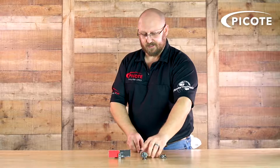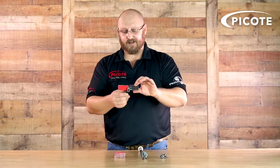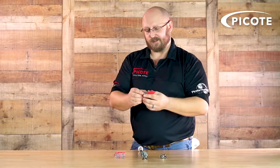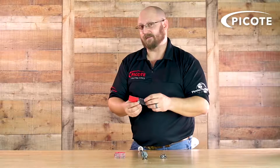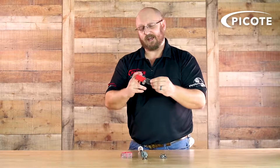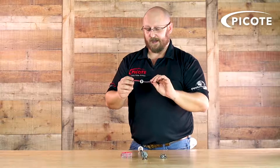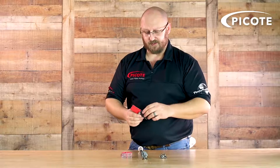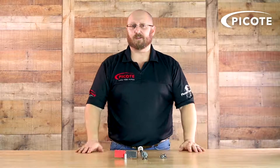In addition to these two cleaning tools, we also have our smart cutter head. It's specially designed — shorter in length so it can navigate through bends more easily. It comes with a pack of ten side grinding panels, so you have several to last quite some time. These can actually be cut and adjusted per pipe size as required, and give a really great finish inside the pipe for cleaning small diameter drains. That's our cleaning package included with the mini cleaner.